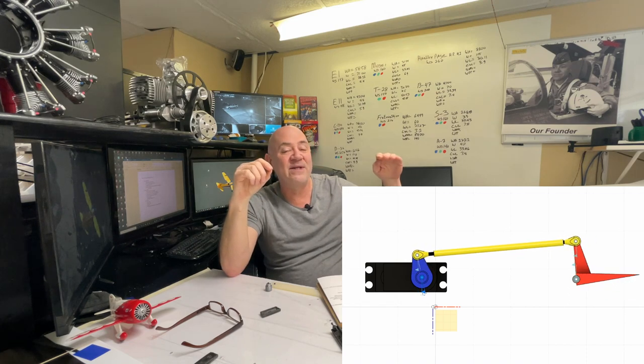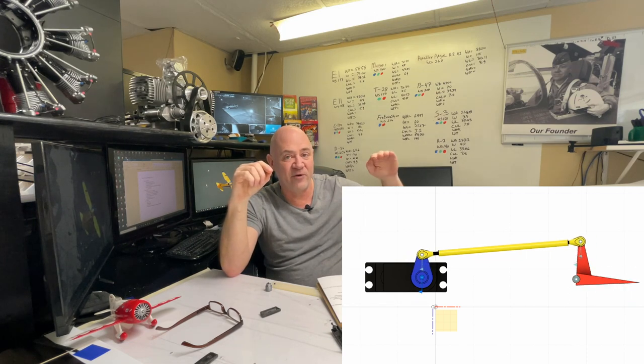After that I started setting up all my airplanes by asking: how many degrees of elevator do I really need? If I need 30 up and 30 down, I put the larger horn at the largest setting on the elevator, start at the inside of the servo — the shortest arm — and see how much travel I get. If I get 20 degrees I might move one hole in or out, but I make sure my deflection gives me the full 60 degrees of travel on the servo.